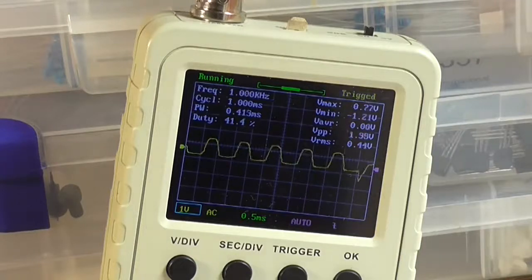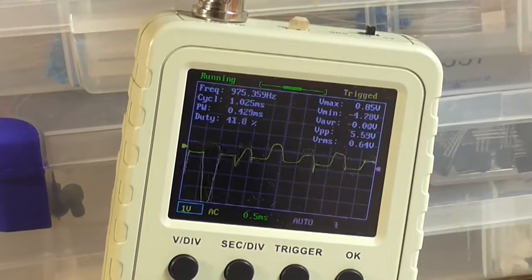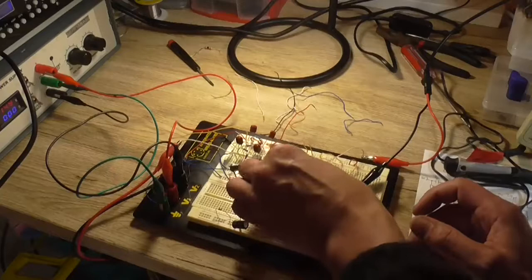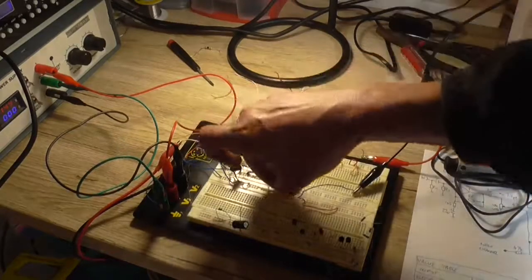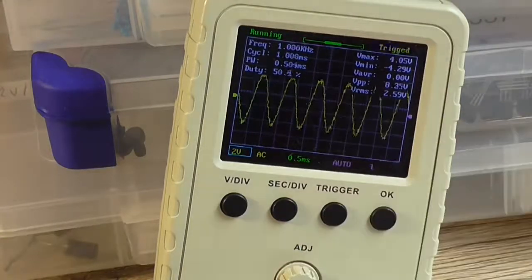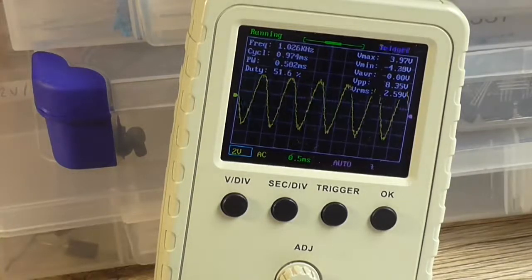I know why, because I forgot to connect the ground wire from the op amp to ground, which is pin 3, which is the positive input. The force of habit, I guess. So pin 3 to the ground plane. That fixed the problem. That looks a little bit healthier, and it is outputting 8 volt. So we change that to a trigger of 2 volt. We've got 8.27 volt peak to peak out. So it's about a gain of 2.2, which is about right.